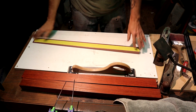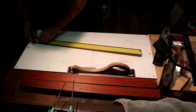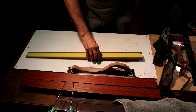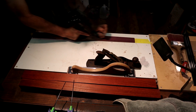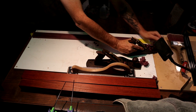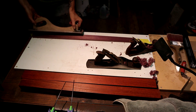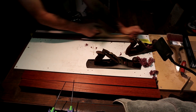We need to do a little work on this wood before we start the glue-up. We've got some masking tape — we need to burnish this. This is my tapered piece of Purple Heart, my center neck section right here. I've used this number four hand plane a good bit. So now that I've got that surface, I'll just hit it a few licks with this sanding board.